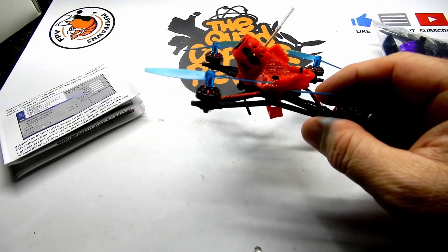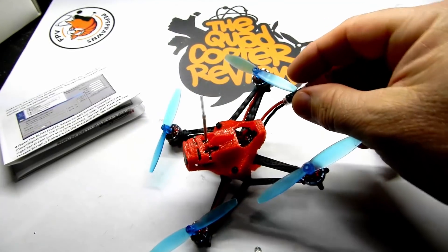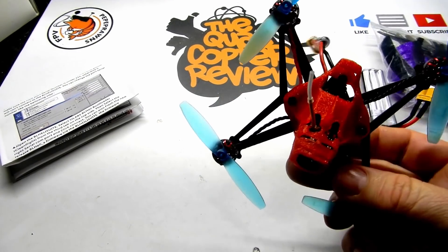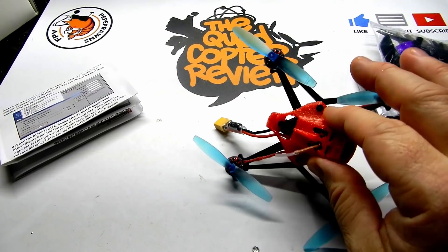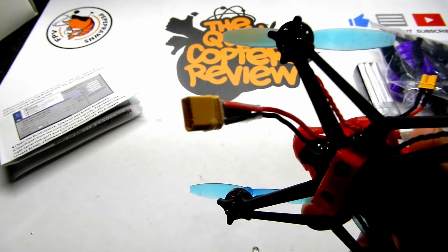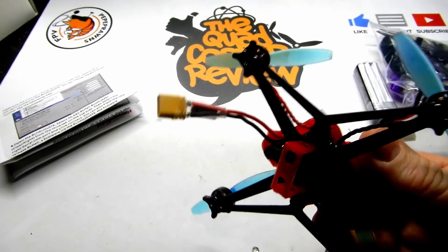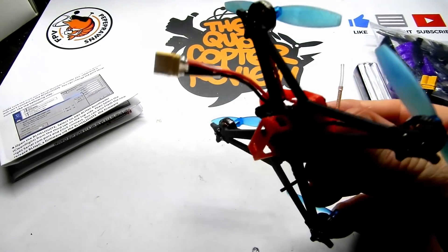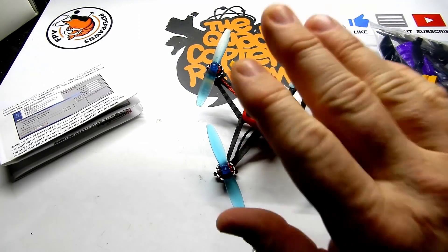It is using the Crazy B Pro version 2.1 board, and it's rated for up to 3S. You'll notice there's a capacitor that has been pre-soldered into the plug. The reason for that is you'll hear a lot about Crazy B Pros burning out — they found it happens most when switching over to the XT30 connector. Unless you leave it at 5 volts, the 5-volt regulator burns out. But if you use the JST2 or leave it as-is, you don't have as many problems. Adding a cap prevents them from burning out, and I had no problems with mine at all.